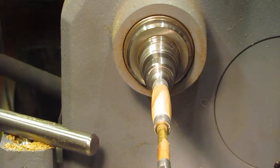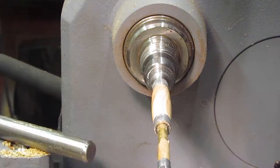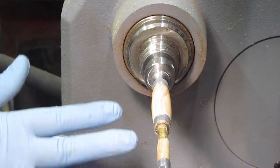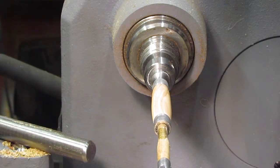Now, isn't that just a glorious piece of wood? This is a great process. It's fairly quick. All we do is use 3 or 4 drops of super glue per coat, and like I said, we're going to put 8 or 10 coats on, and we're just going to wipe them over the blank. The blank is not moving fast. I'm not going to adjust the speed, which I think is only 450 revs, so that's all that's needed. I've got a glove on, you can see my glove there, because this stuff's horrible, and I'm going to put my mask on.